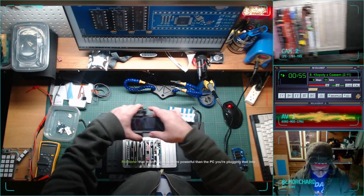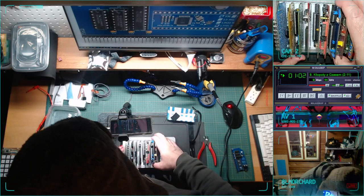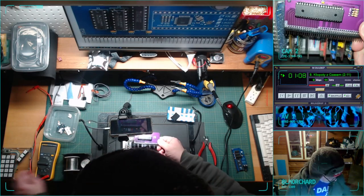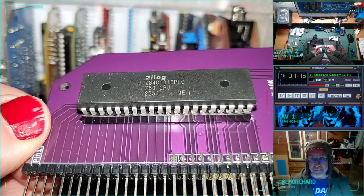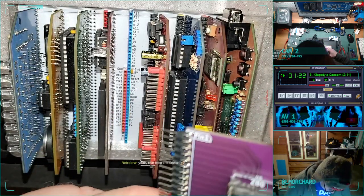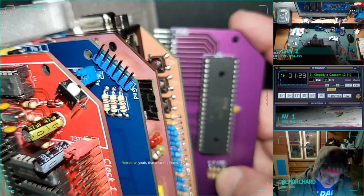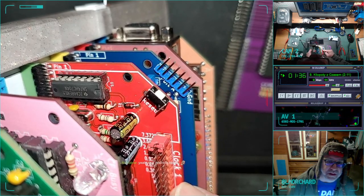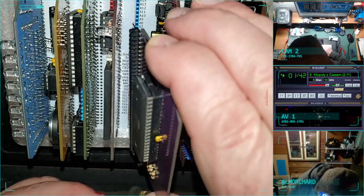We get this kit computer that runs on a Z80. This is the CPU board, and it's just a Z80 CPU. This thing runs CP/M on a Z80. Got 512 kilobytes of RAM, and it runs at 7 megahertz, because this is the clock board, and it's set to like 7.3728. Yeah, it's not a beefy computer. It's a fun computer.